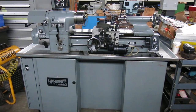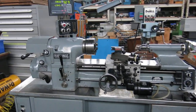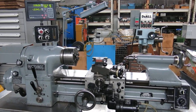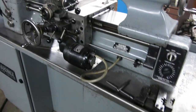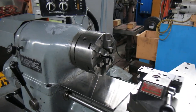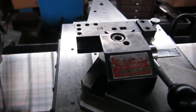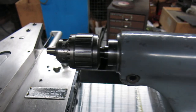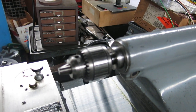Today at Merlin Machinery, we have a Hardinge HLVH Super Precision, serial number 10180 — I believe that's a 1982. It's all original paint. It's got a Buck Adjust-True six-jaw chuck on it, a KDK low-profile tool post with five holders, a Jacobs ball-bearing super chuck. It's one of the smaller ones — I believe that's a three-eighths capacity.